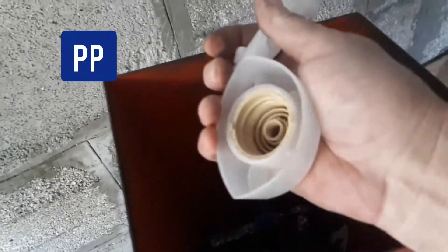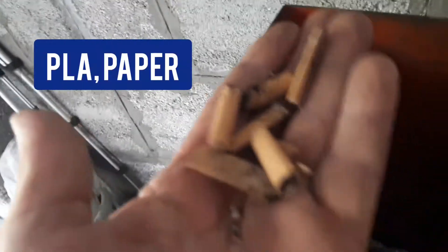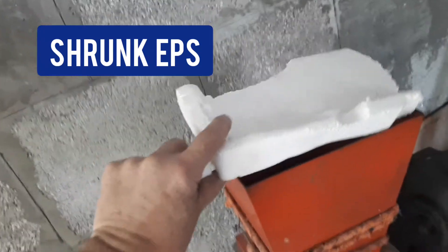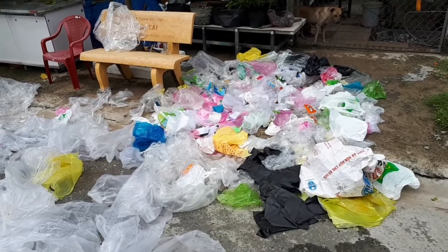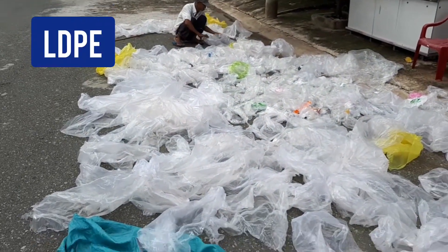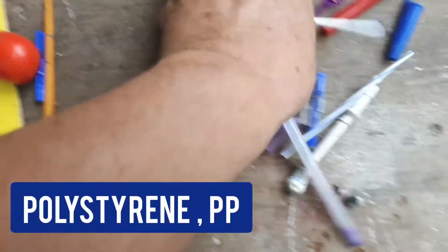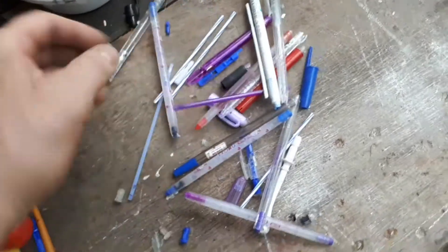This is why we down-cycle everything to sticks, and later we up-cycle the sticks to furniture. This is styrofoam — you must shrink it first, then you can use it. We heat it up, shrink it, and then shred it. This is of course low density polyethylene. Everything with color on it they cannot use for a clean product. This is also polystyrene and sometimes a bit of PP on it.